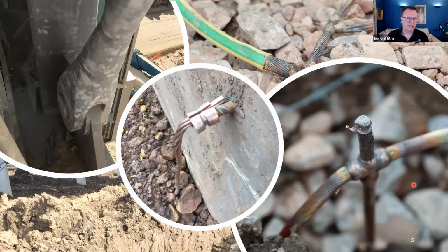But I don't think it'll make a massive difference to have a radial spur just for testing purposes. I can't see that being a problem, because you're electrically connected to the earthing arrangement. It might be better to have two connections, so that if one gets severed by a digger or something, or inadvertently ripped out or disconnected, you've got redundancy with the other connection.